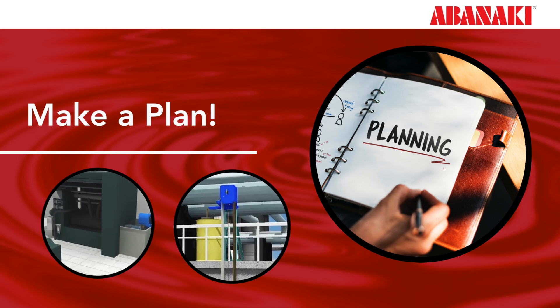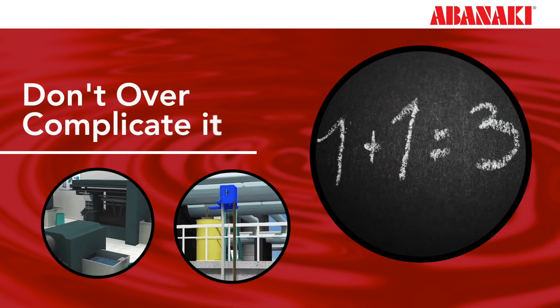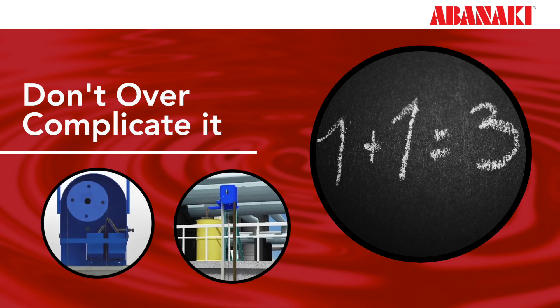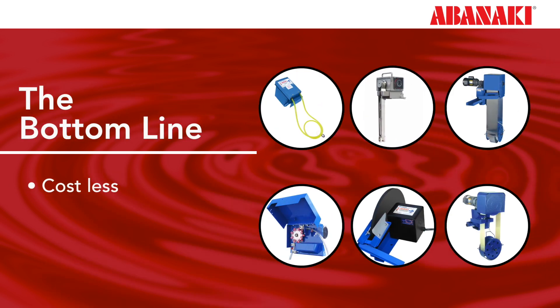Always make sure your tank gives enough residence time for the oil to float. Oil skimming usually beats ultrafiltration systems in many applications. Installing large, complicated systems to remedy oil problems will not provide ideal results. You can save costs by using a relatively inexpensive oil skimming system to handle the free-floating oil and then a smaller treatment system to handle the oil that has remained suspended.